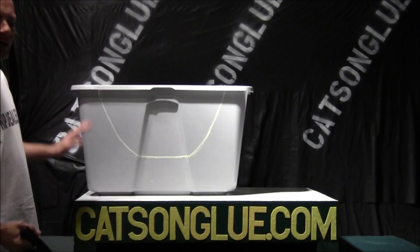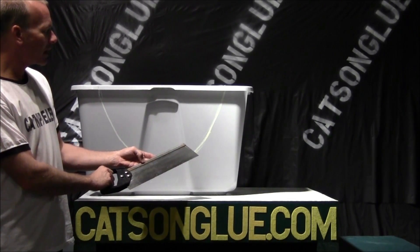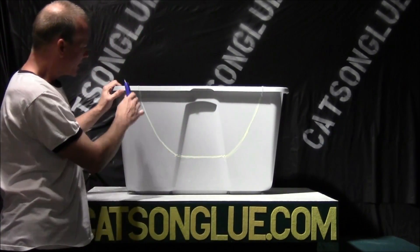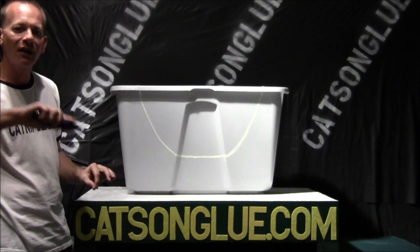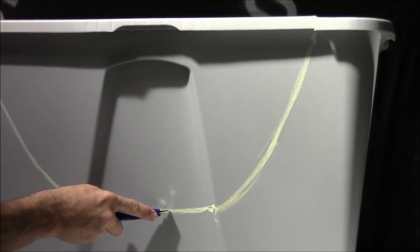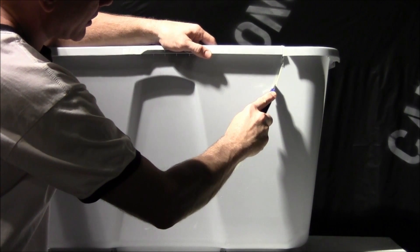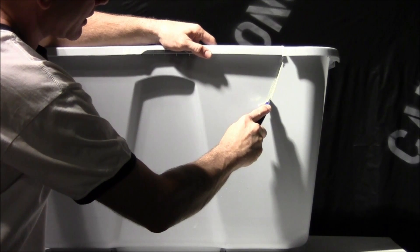You can either use a power saw or you can use a handsaw. For this next cut we're just going to use a handsaw. We're going to make a light score through this like we were scoring a piece of glass, then come back and cut it through once or twice more — it should make a really nice even cut without a lot of wobbles. Let's go over this one more time and you can see it's opening up nicely, going slow and following the scored cut.